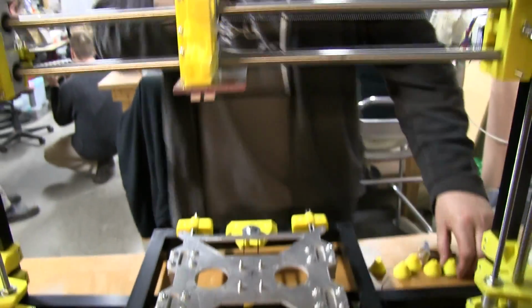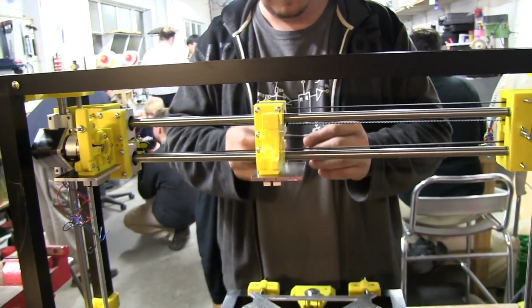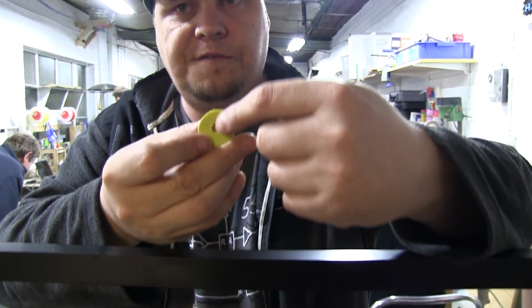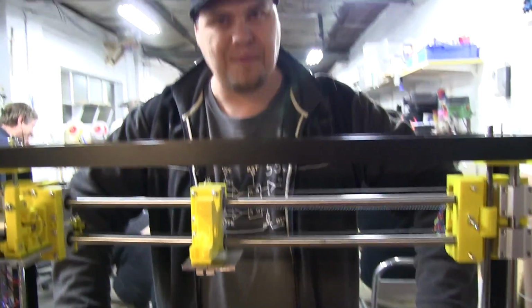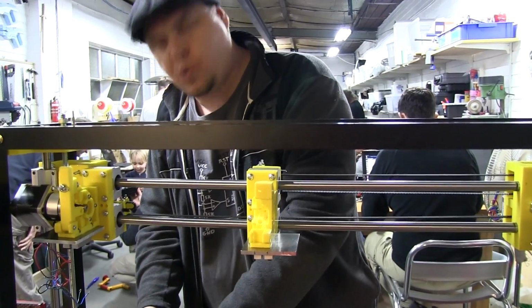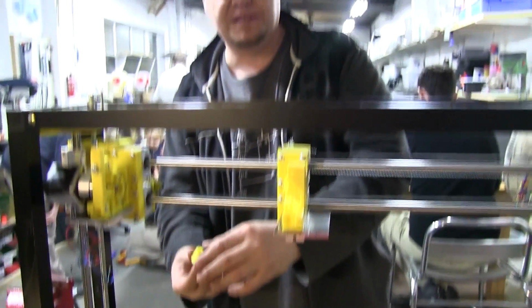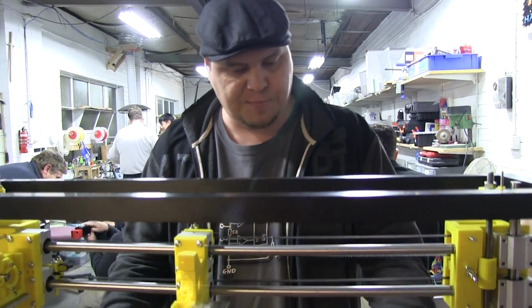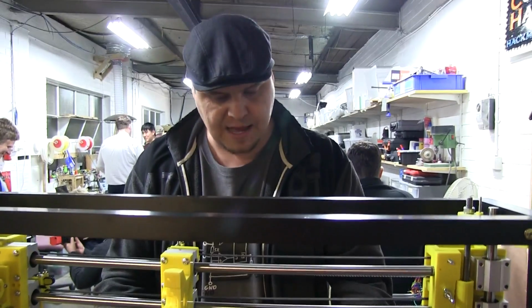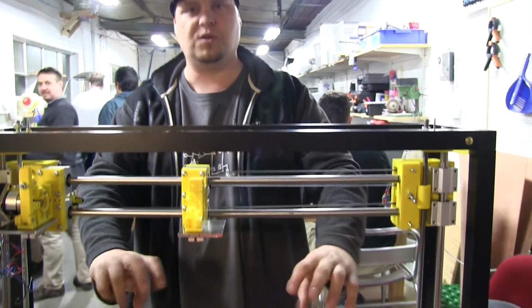And how are you going to clamp this onto the base? Okay, so what's going to happen now is I want to be able to make it level, so I printed these feet. Basically it takes a 5mm bolt and a nylon nut, and unfortunately I have to pull this frame off because I've got square blocks made for here that have countersunk nuts in them, and I'll drill holes and make the feet adjustable so I can crank it up. Once I've got it up off the table, I can mount 5mm bolts through the base that this will then centre and lock onto.